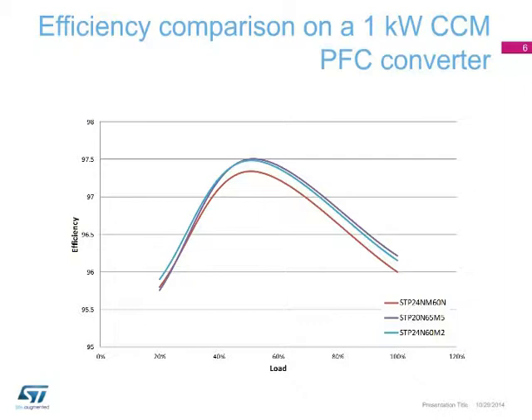If you are looking for a MOSFET offering low on-state resistance, we recommend that you select one of our MDMesh M5 MOSFETs, which feature one of the industry's lowest RDS-ons per area in all package options.